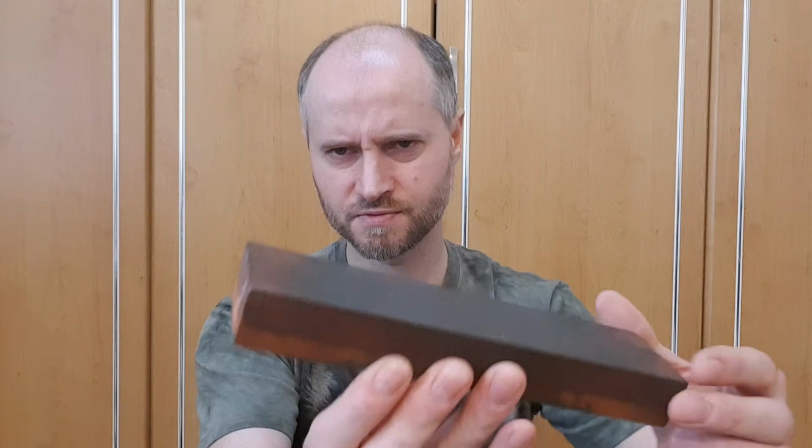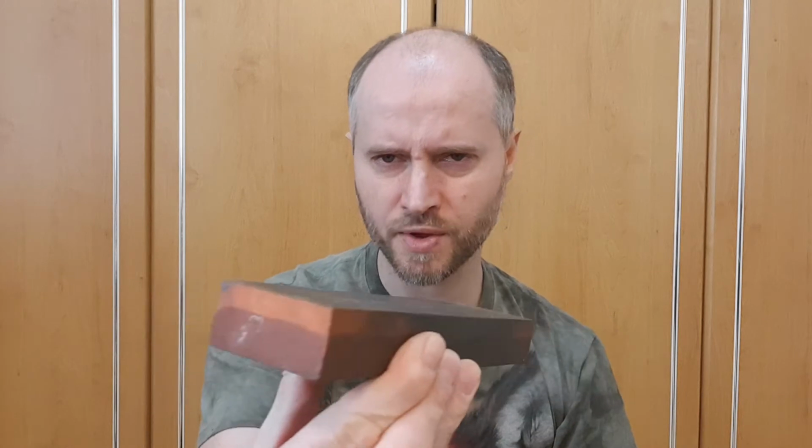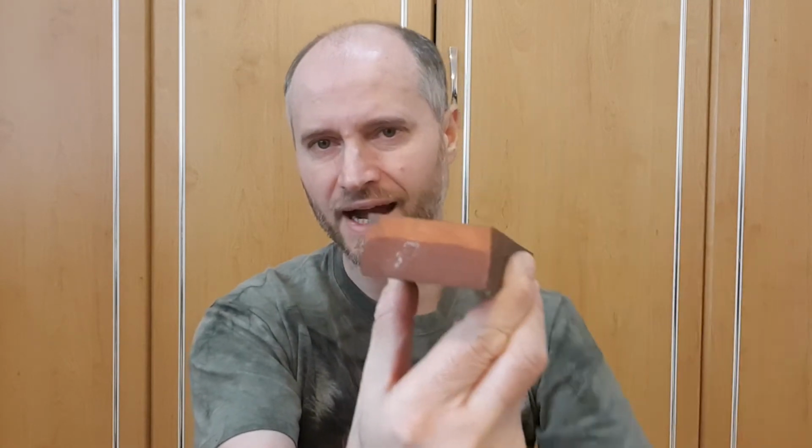So I bought these two-sided stones. This is not a water stone. This is some carbide stone too, as you can see, with two lines. This is the harder, rougher surface, and this is the more fine. And when I had this one and I'd like to put more edge on it, I use this one, use the water on it, and really start to make a polished convex, and then I learned how to put a really sharp edge on it without any machinery. So these were generally the tools I used for that, and it really works.